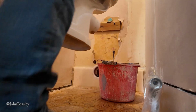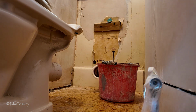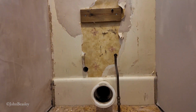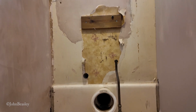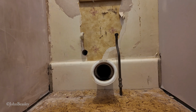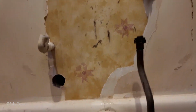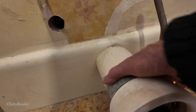And if you don't do that, that's all going to be landing on your stair carpet as you try and haul this thing downstairs. The chances of your new WC pan fitting directly into this existing arrangement of supply, overflow and sewer outlet is reasonably optimistic, I would say, but more than likely this was installed here donkeys years ago, because we've actually got a lead incoming 4-inch pipe.